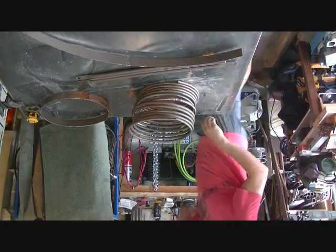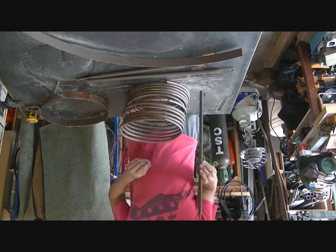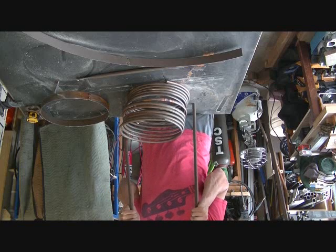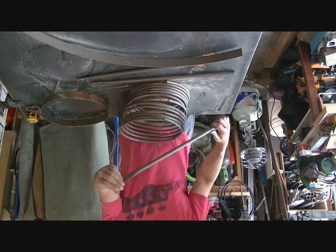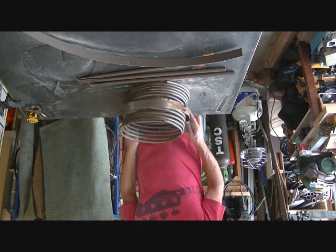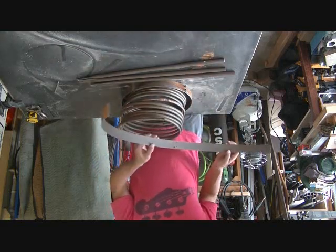Okay, so now what we need to do is have this raised up off the ground approximately 28 inches to the bottom to engage the heating element. So we're using some material. I got some round tubing, three of them. Whenever you make something that stands on uneven surfaces, three points of contact always touch. Whenever you have that fourth one, sometimes it'll wobble and that fourth leg won't touch. So we have three. They already got a nice flattened end with a hole on the end to fasten to the bottom. I've made a ring. What that'll do is it'll go at the bottom, right? Then we'll have two or three riser bars, and then I have to make another ring here for the top.